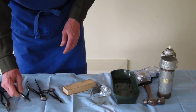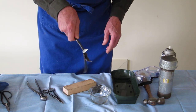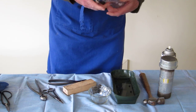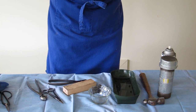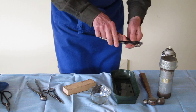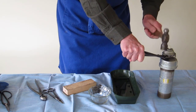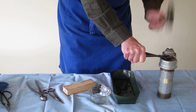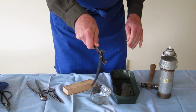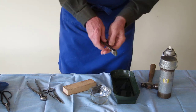Let's try the concave cutters. We're getting some rattling out of the concave cutters, so I'm going to put on my eye protection and hammer on the soft metal rivet which holds the two blades together. Put that on the anvil, and you'll notice there's no rattling now — we've adjusted the tool and we're ready for the next step.